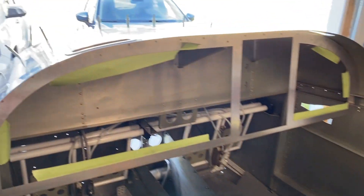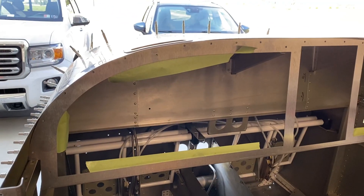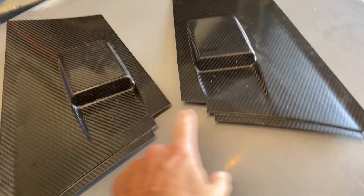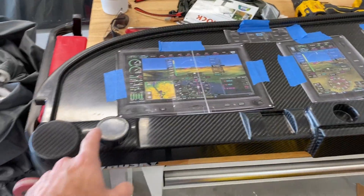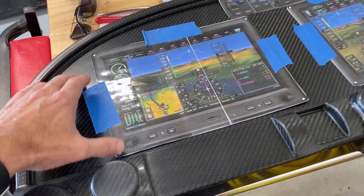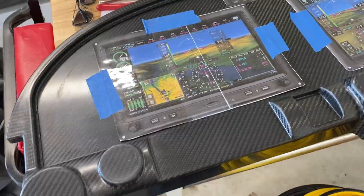Over here on the plane itself, I've just got it laid in, but this is the frame for the whole carbon fiber setup. Now what I've got to do is fabricate some brackets that hold it down here on the bottom. Then I've got to start thinking about assembling this piece, which is going to require drilling some holes. And of course I've got a lot of cutouts to do — this part here is actually not going to stay. You cut almost all of this out, and then you put in a metal panel insert which gives it rigidity for mounting your avionics.